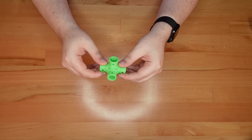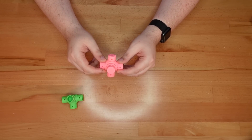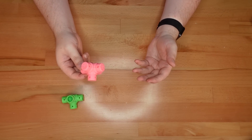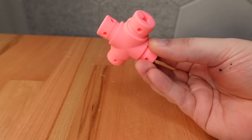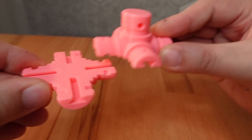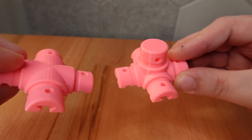I let aesthetics override function, as I focused on hiding the seams. But if we place the seams straight through the connector, like this, the areas of greatest stress are now solid plastic. And as a bonus, this means that every single connector, no matter how many ports it has, can be printed in only two main parts: the section above the seam, and the section below.